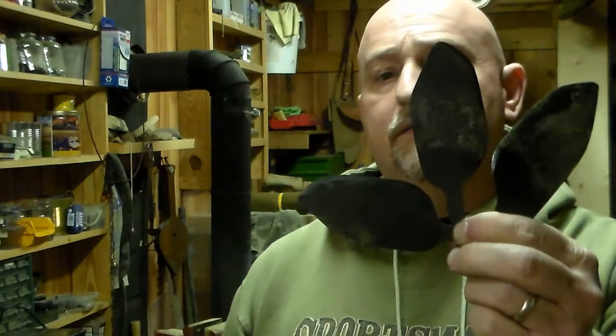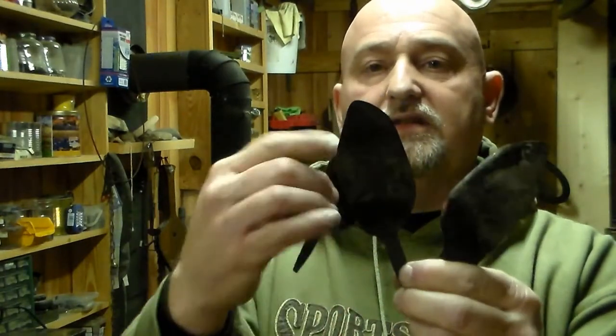That's my son — he's telling you what I'm actually doing. The camera did not pick up the sound very well due to a fan, but basically he's telling you that by quenching it with the oil it hardens the metal and makes the blade very hard. Now they're hardened back and put back into the hard state — you can hear it.